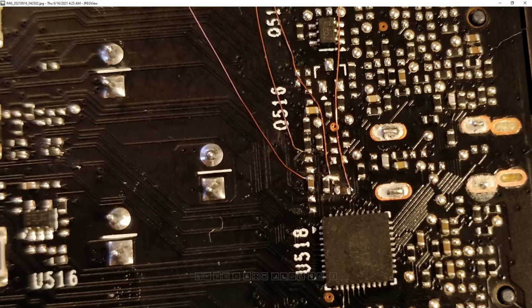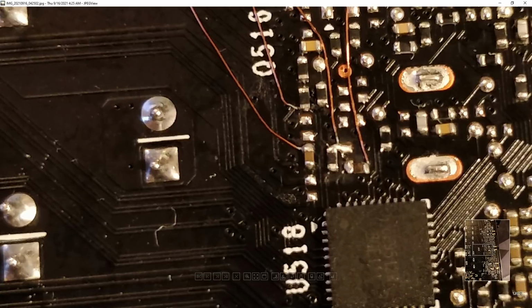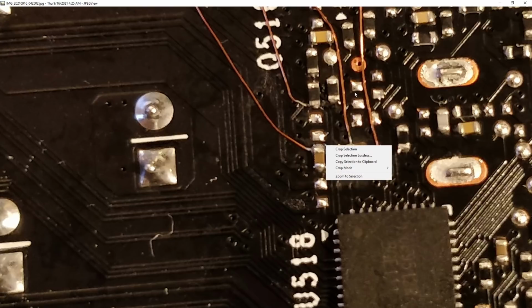And I've not measured it, so I can't tell you what the value of it is. Or more like, I measured it, I realized that there's no way I'm finding a replacement for it, and from then on, I made very sure to not lose the damn thing until I got it set up in this configuration over here. And so that's how we deal with the ref ADJ part of the circuit, and then over here we have a capacitor. I wonder what that could possibly be for. Of course, it's the 2-volt VREF circuit.